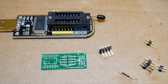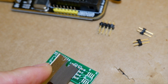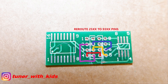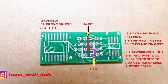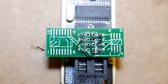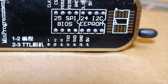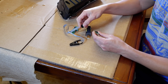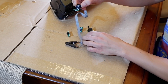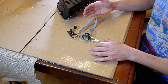To summarize what you need to do: they give you this blank board with no pins in it, so you have to add pins to it. You actually have to cut some of the traces and then provide new traces. What I did was use some wire wrap wire from my electrical engineering days and soldered these new connections as you can see on screen. That basically converts the 25 series slot on the ZIF socket to a 93 series chip so we can actually program it. It comes with this little clip that allows you to plug the chip clip into the slot on the board, then that board goes into the ZIF socket, and then you plug it into your USB port. You pull up AS Programmer and you're able to read the chip.